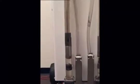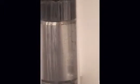There was a lot of grinding and stuttering with the conventional plunger with sand present. Notice how the sand settles on top of the connector and plunger. This will cause the plunger to stick even more. Also notice the sand that is caught between the plunger and the pump barrel wall. This is where the problem is.